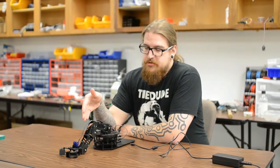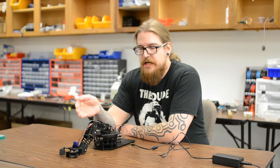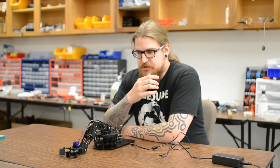Here again with a demonstration of the Robot Geek Snapper arm. We're going to do a quick code demo on interpolation basics. Generally speaking, when you write positions to servos using the default Arduino library, it is simply going to move those servos as quickly as it can to their desired positions — that's great for some people.